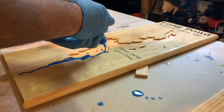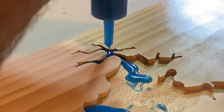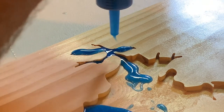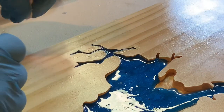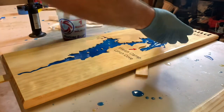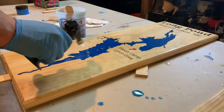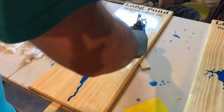Let's pour some epoxy. I use a syringe for this because it just makes my life a whole lot easier. It helps with these really tight spots — I can just let it trickle out of the syringe and I don't make too many mistakes. Just kidding, I make a ton. In cases where you put too much over your cracks, you can go back with the syringe and suck it back up and use a paper towel to clean it. Problem solved. Once the edges and tight spots are filled, you can go back through the middle and fill up your lake pocket with epoxy. Just make sure you don't fill it over the top of the edge so it overflows onto your workpiece. Once you're satisfied, go over it very lightly with a torch to pop the bubbles. I like to do this two or three times within the first ten minutes of pouring. And here's what you're left with.